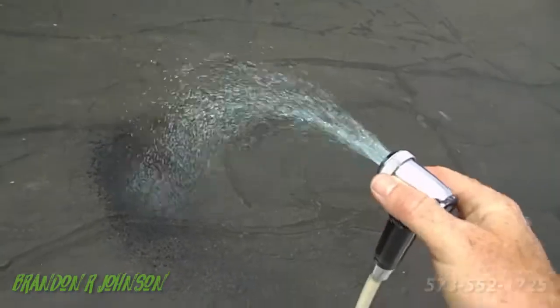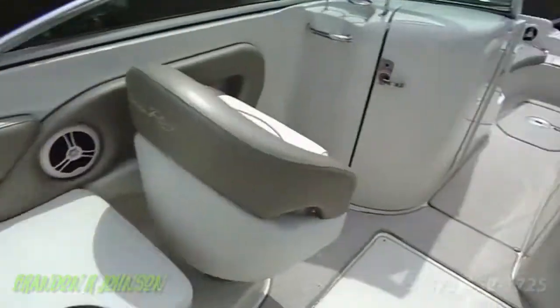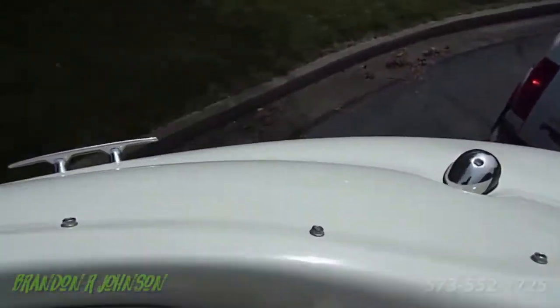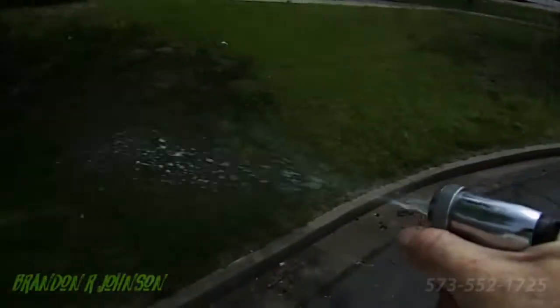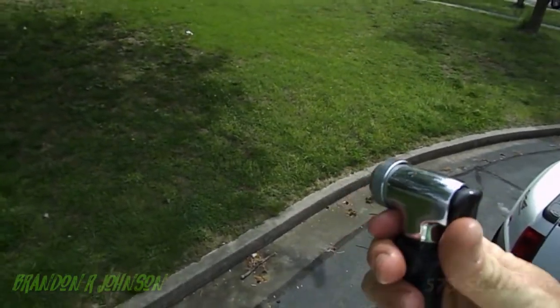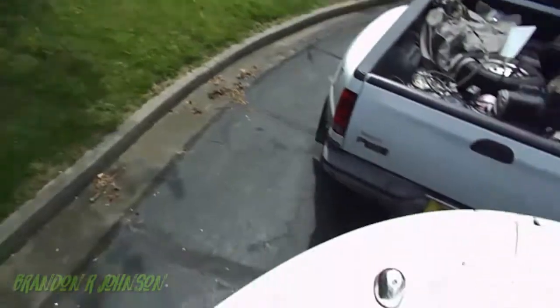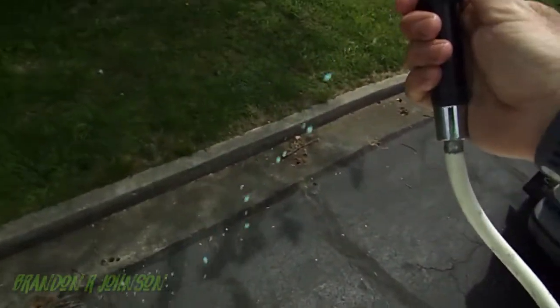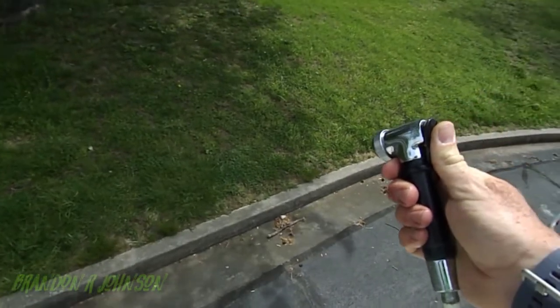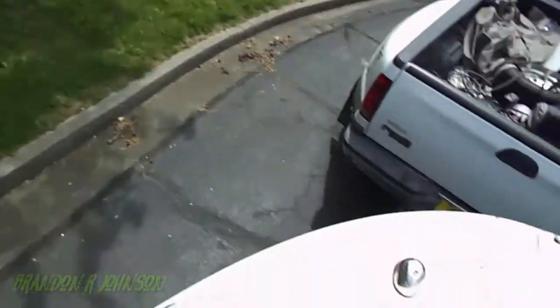Back to the lines. Transom shower — some of these have it, this one does. Bow shower sprayer — wash your anchor down. You can see the antifreeze, but it's got pressure, and that's how you know it works. There's some air — this one's the farthest from the pump, so it's taking the longest to prime.